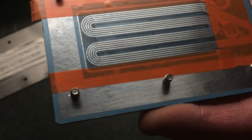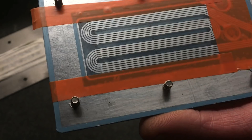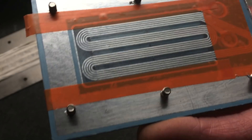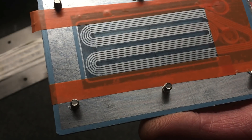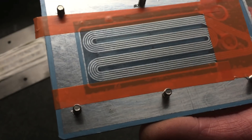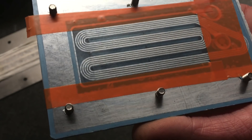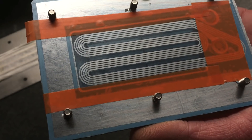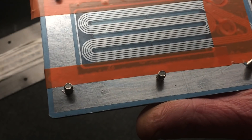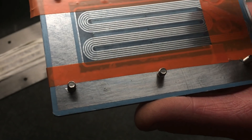The intent of the PDR version of the Neo3 is getting better dispersion and getting the resonance a little bit lower, so you can cross it more easily instead of having a huge hump at 2.5kHz where you'd have to cross it way above. The PDR has a resonance of around 800Hz, and mine has 600Hz.